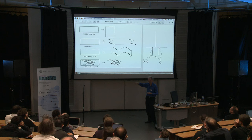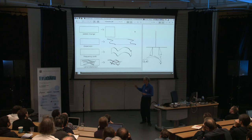Or you can do frequency shifting, which is, you get your knob on your little Bode box and up and down the thing goes, time variably, and that's the thing that you can also do absolutely cleanly. So for some reason, area-preserving transformations seem to be a thing that doesn't harass the signal in a way that causes artifacts. Artifacts are caused by things that are not area preserving in some way, like time stretching. When you do that, you will get artifacts.